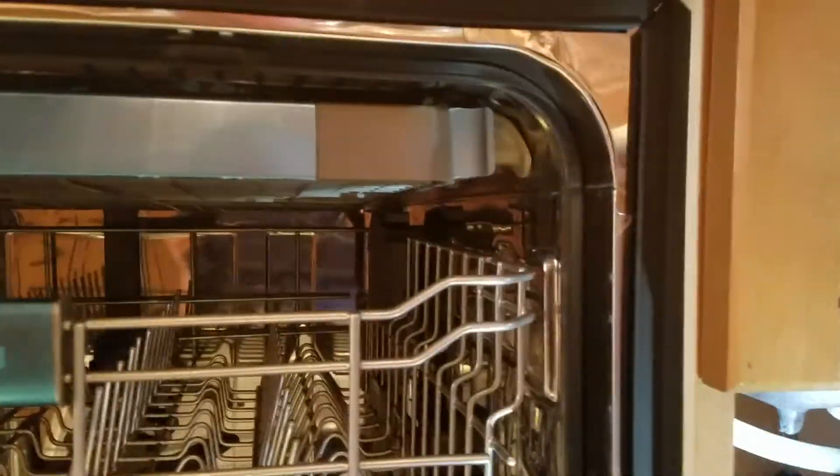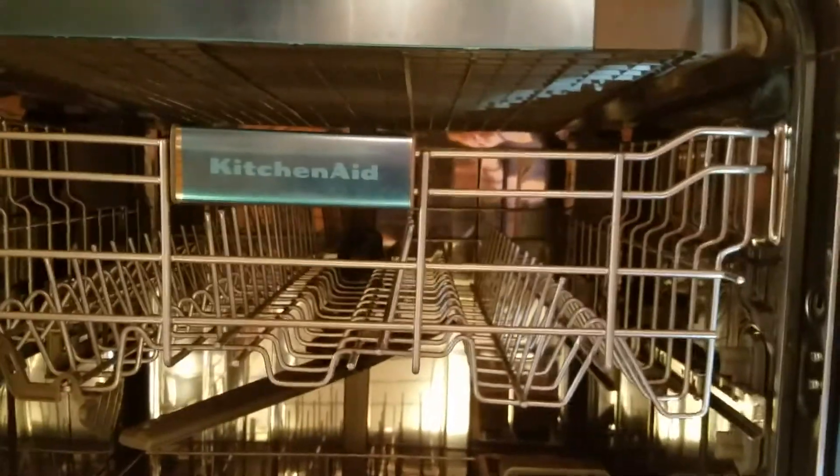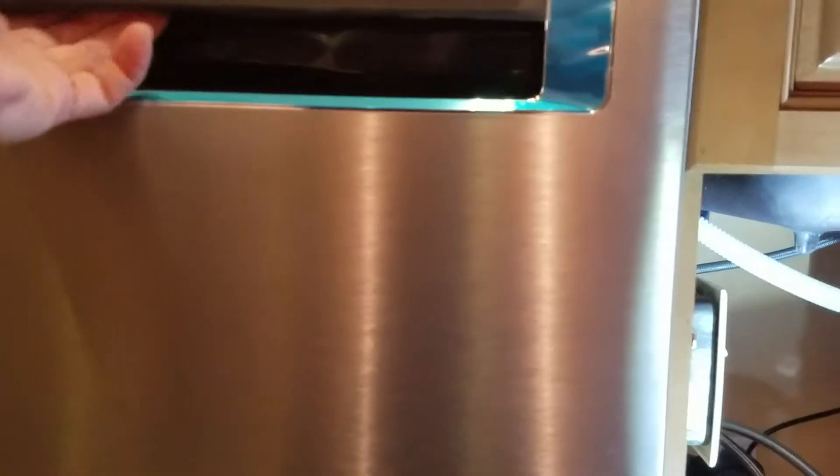It was a little more complicated than most dishwashers. The base itself was not sitting level enough, and of course it just had to do with the alignment of the inside box. We got that addressed and now it closes correctly — no banging on the sides. That was the homeowner's suggestion, so they took care of that.